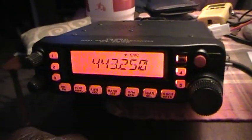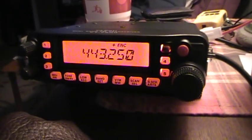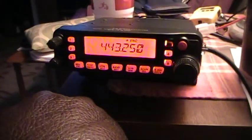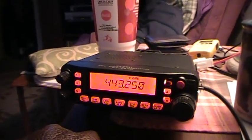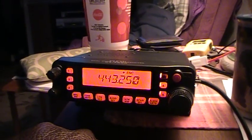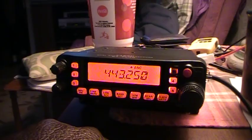you're going to need to run this radio at home. You're going to need a power supply, and you're going to need a minimum of 10 amps continuous. What I did was I went and got an, or not an MFJ, but a Pyramid, and that's the PS15KX. There you can see it's wired in right there, and it also has the cigarette lighter socket. When I put it into the truck, I'll be using those power plugs, quick disconnect. I'll run 12 gauge or 10 gauge, probably 12 gauge, from the battery into the cab, and just use quick connectors like this one here.